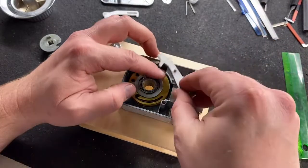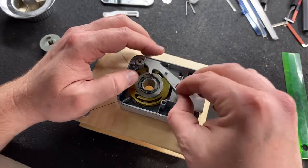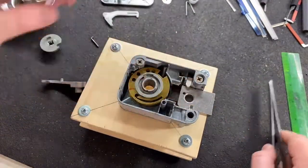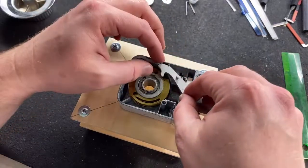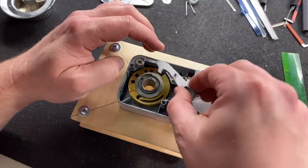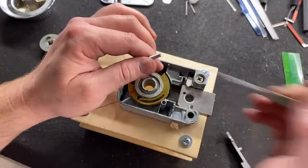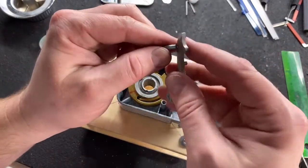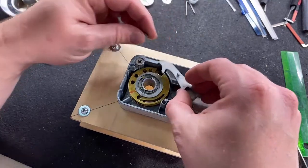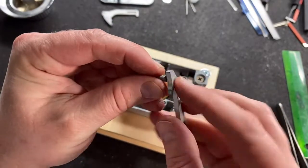Yeah, I think if I were to drill this arm and then tap it, as long as I got it in the right spot, it should actually be right about where that circle is, from best I can tell. Drill that out and then tap it. I think there would be enough left here. If not, I've got more of these bolts. So let's see.